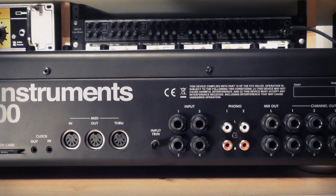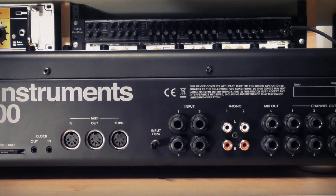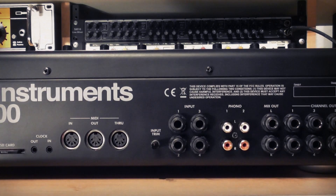You can see that there are four mono line inputs and two stereo phono inputs. Input one and two and phono one left and right run through analog anti-aliasing filter circuitry like classic machines did in the 1980s. So if you want that retro sound this is part of the equation, but we'll discuss the full technique when we cover sampling later in this video.